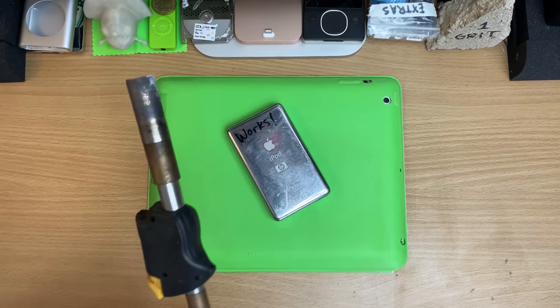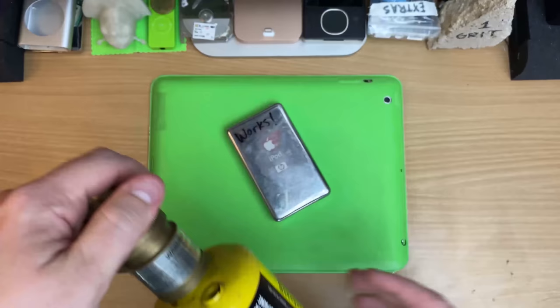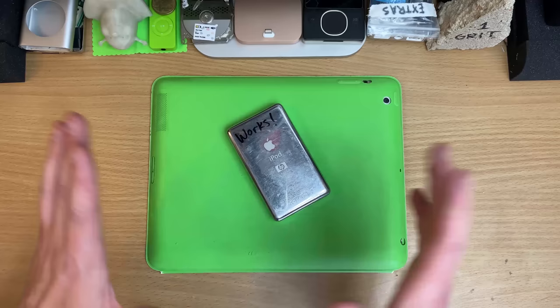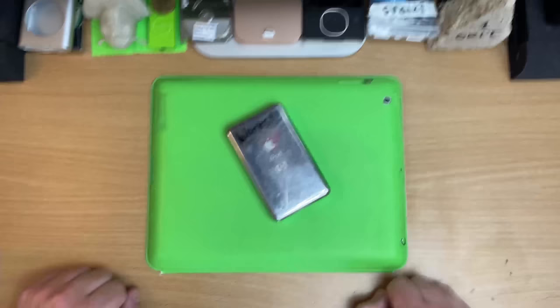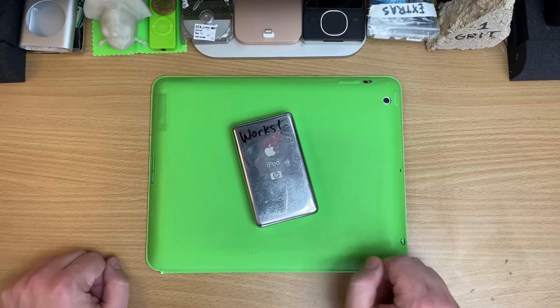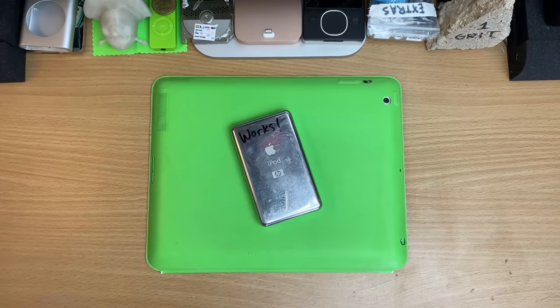This is a map gas torch. I was having my hand at aluminium braze welding trying to fix the mounting points on the bell housing of the transmission of my XF panel van. You could use butane torches — they don't get as hot as this, and I don't think you need to go as hot as this. But that basically means this is dangerous. So don't do this inside. Don't do this next to your petrol rag collection or any of that sort of stuff. Don't do this anywhere near flammable stuff — or even don't do it at all. This doesn't make your iPod work any better.